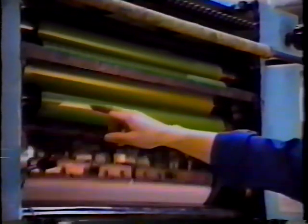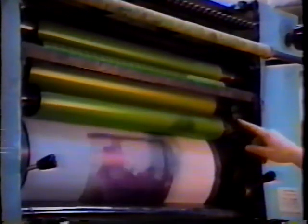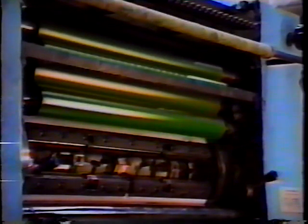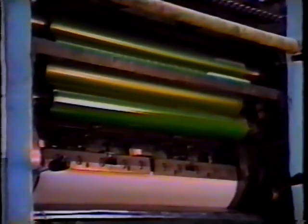Now we can see that we're starting to transfer ink between the vibrator and the form roller, the same on both sides. Again, we'll stop the press, wait a few seconds, maybe a 2 count or a 3 count, and again reverse the press and check our stripe. Now we can see that we've got a fairly uniform stripe all the way across the roller. Slightly lighter on this side than this side. So again, we'll tighten. Maybe a 1/4 of a turn or so.